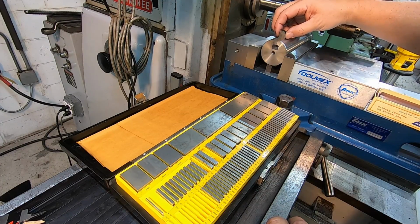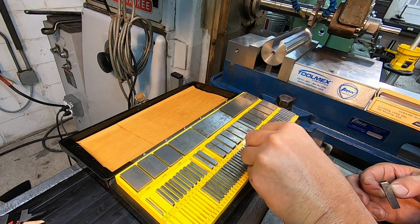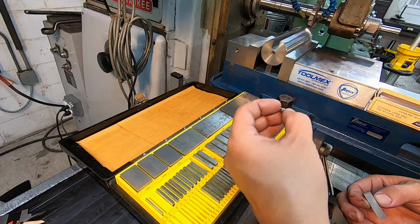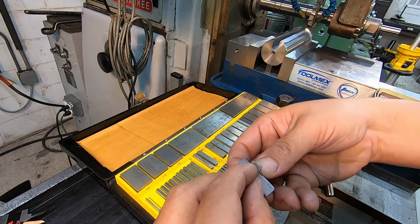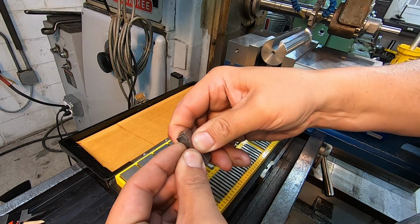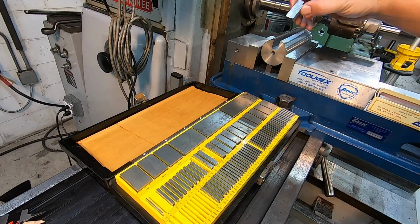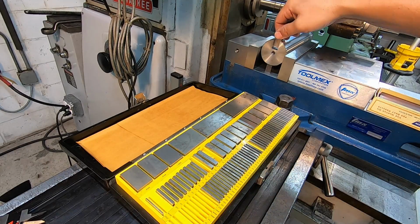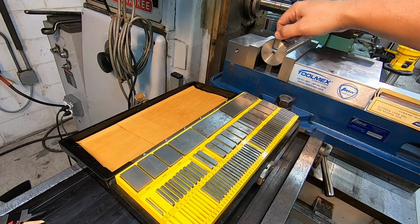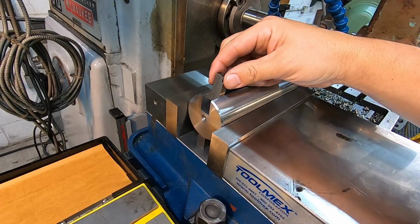And that one is a little bit tighter, but still no dice yet, so looks like we're going to be real close on our size. Let's see, without polishing it, let's see if our 114 will ring on there. All right, we got that one rung on. Try it. All right, there we go. That actually fits with just a slight amount of friction there. Let me get you a little closer so you can see. All right, you see we go in there.